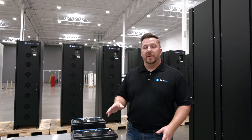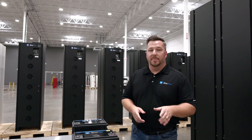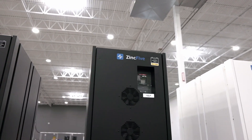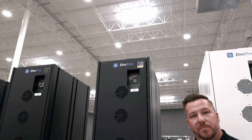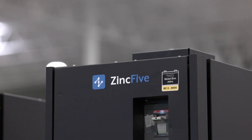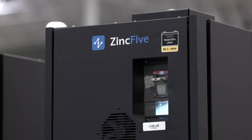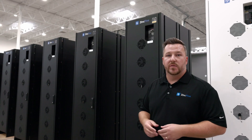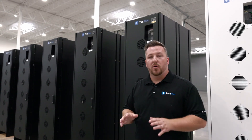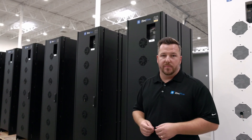Now let's look at the BC2-300X and BC2-500 solutions. Our BC2-300X uses our standard BC2 cabinet, same bus bars, same BMS, except we've swapped in our 90 amp hour battery. That gives the 300X more run time at the same power levels — it still targets 800 amps of continuous current, but for more run time. It's perfect for customers looking for longer than five minute run times while still wanting a power-dense footprint.